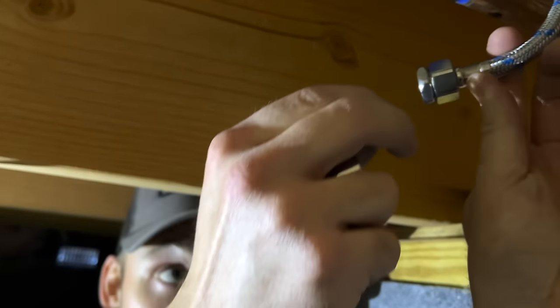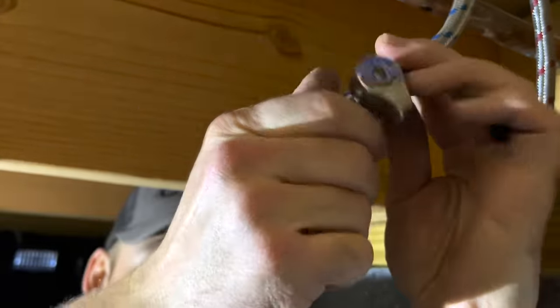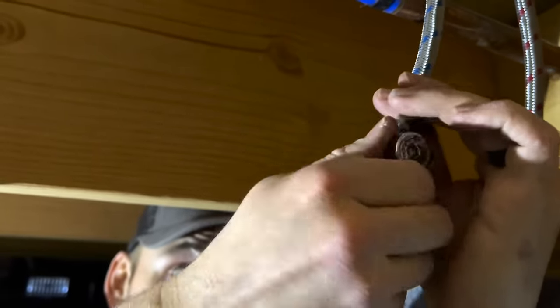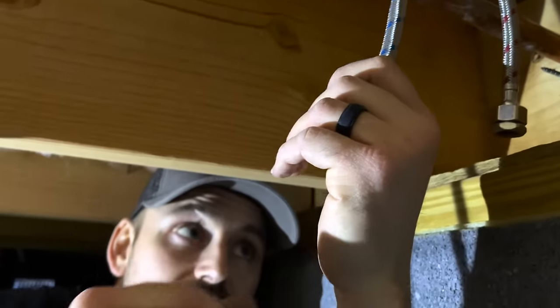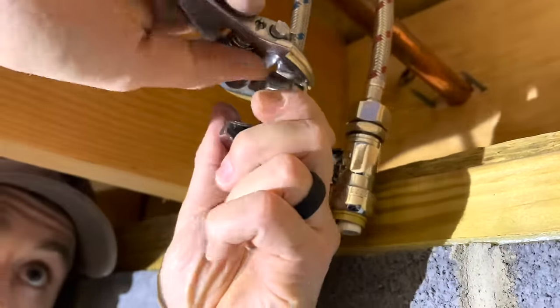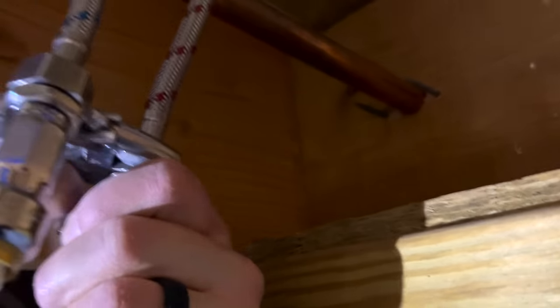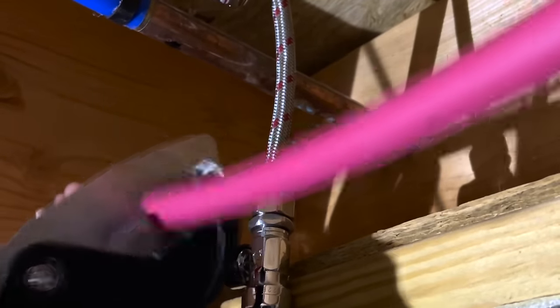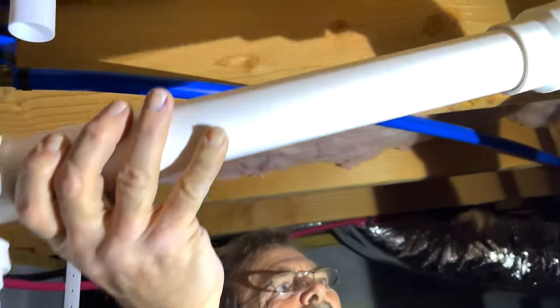Now directly below in the crawl space, I first installed the rubber washers that came with the faucet into the ends of the water line pieces, then hand tightened the SharkBite push-to-connect fittings — these go from 3/8 inch to a 1/2 inch water pipe through simple quarter-turn shutoff valves. I'll repeat that process on the hot side, then use a crescent wrench to tighten everything down snugly. I'm using a ratchet pipe cutter to cut the PEX pipe to length to meet the quarter-turn shutoff valve, then push the SharkBite fittings onto the water line.